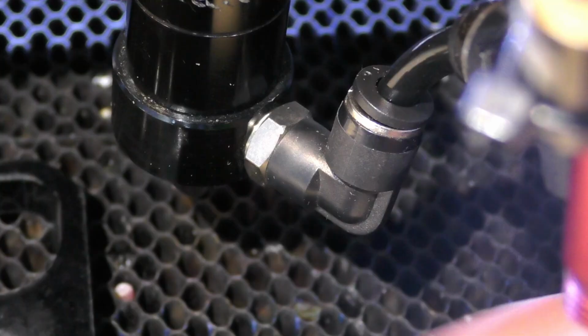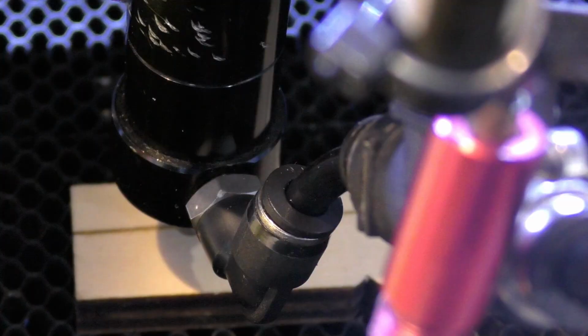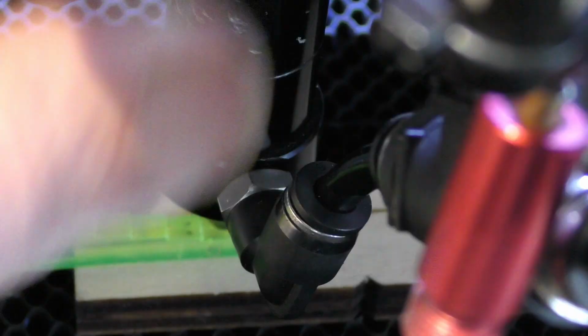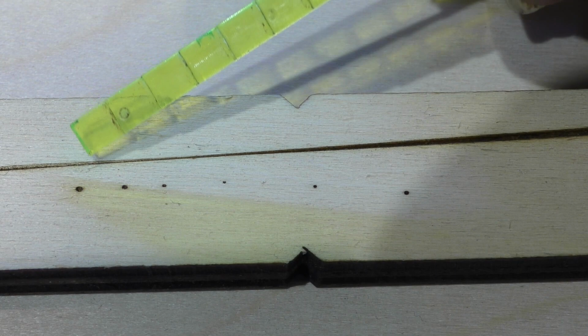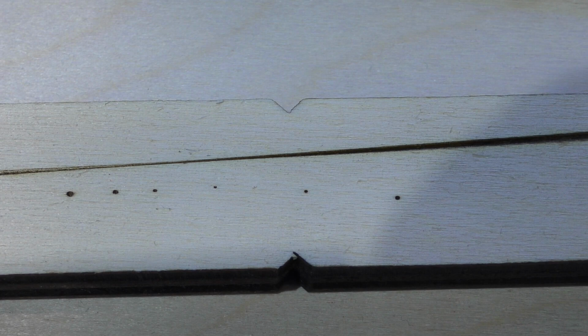There is yet another way of determining the focal point. Let's just say we'll drop it down to 4 millimetres and we do a pulse. Beep. We'll run along a little bit. We'll set it to 5 millimetres and we do another pulse. Beep. So look, 4, 5, 6, 7, 8, 9. Is more accurate than the ramp test. And this is good enough for what you want.